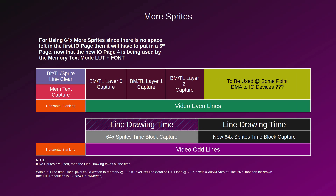Let's get technical for a moment. During the even lines — the video lines — information is captured for the upcoming lines. Early on, the sprites and bitmap lines inside the graphic engines are erased, and the previously prepared data is transferred to be displayed. So while new information is being displayed, memory is being fetched for the new content — bitmaps, tiles, and so on. Now that we've doubled the bandwidth, those fetches take half the time they used to.